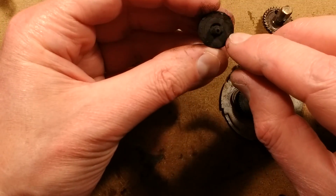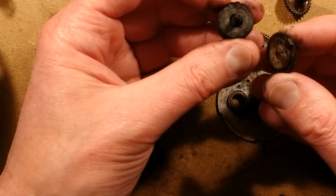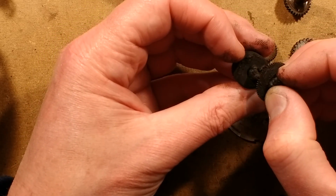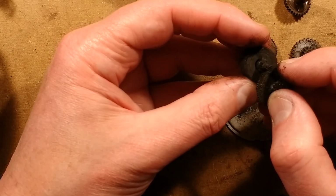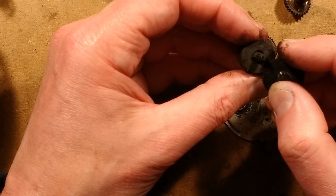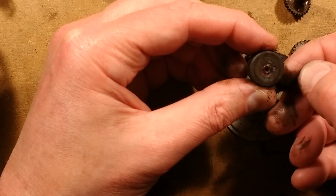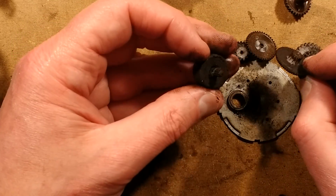It's also worth mentioning, this one has a little stem kicking out the side. I'm trying to see, where is it? This has a mechanism that rotates underneath it, and it very simply slips backwards and forwards, but as it slips, if it's going the wrong direction, it will actually ride onto this and it will physically stop this rotating by that little collar, and then it will kick off in the other direction. So if it's going in the right direction, it will wind that sort of out the way, but if it's going the wrong direction, it will wind in until it physically stops it and it will kick it off in the right direction. This one didn't. This one used to actually just go in a random direction, mainly because it was just filling up with gunk and everything was just sticking up and stopping working.